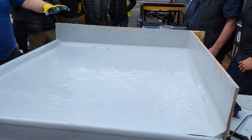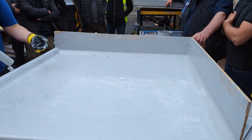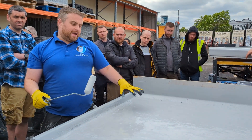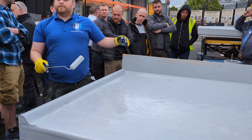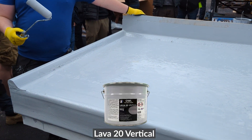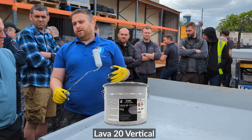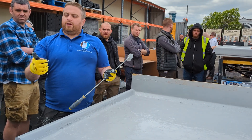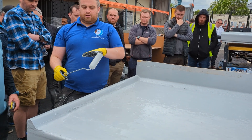You can put the second coat on straight away. Just use the matting — it's simpler. You can go wet on wet: liquid, matting, liquid straight away. You can build it up to your two and a half mils and leave it at that, or you can come back the next day and put your dark grey top coat on. For maximum angle, you can put it on a vertical surface if you want. We also have a product called Lava Vertical — same thing in a thicker form for vertical surfaces. I'd recommend getting your 2.3 to 2.5 mil build-up using matting in multiple coats. Use matting or use the Lava Detail or Lava Vertical — that's how you build up the thickness on a vertical or sloped surface.